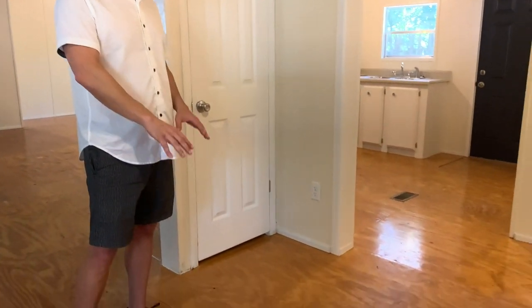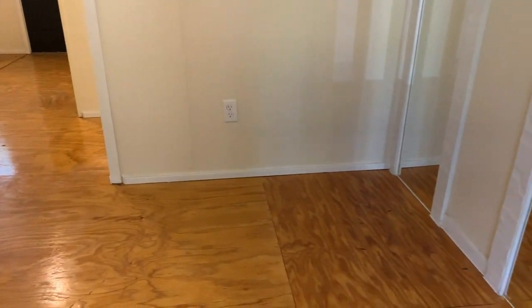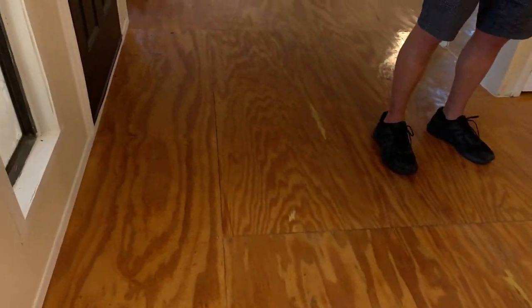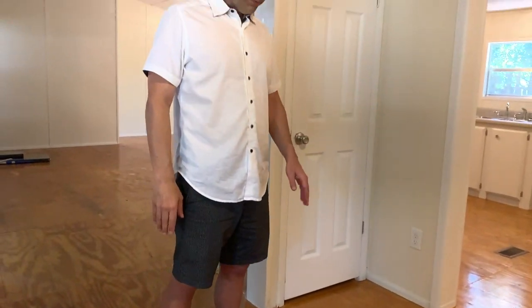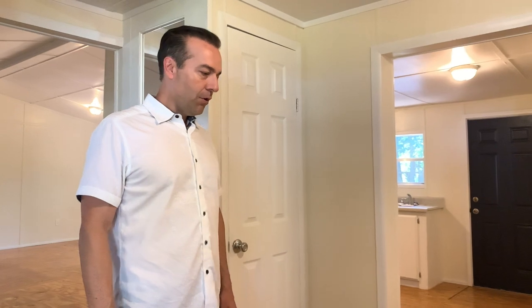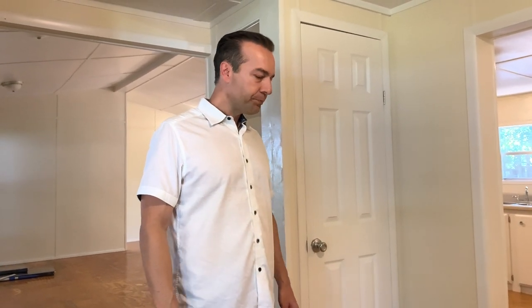You can see here what we've done. In mobile homes, the flooring is really — I call it just souped-up cardboard. So what we do when we buy a mobile home is we take out that flooring, or go on top of it with 5/8-inch plywood. Then we fill the cracks with wood filler, fill the screw holes with wood filler, and then polyurethane — two, three, sometimes four or five coats. It really shines up nice. Tenants in this price range like it; it's almost like they have wood floors. And it makes it so that nobody's going to fall through this wood floor. For those two reasons: one, it is a bit expensive — this plywood goes for about $30 a sheet, plus the polyurethane and labor. But once you do it, you're done — 20, 30, 40, even 50 years. Every once in a while, when a tenant moves out, you lightly sand it and do a whole coat of poly in the whole house. Indestructible floors. Nobody's going to fall through it.